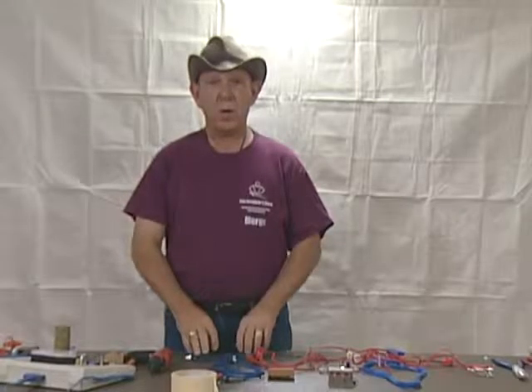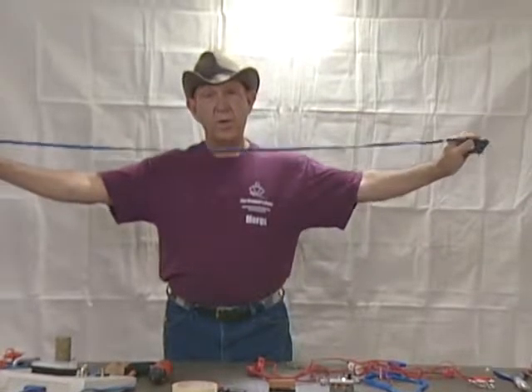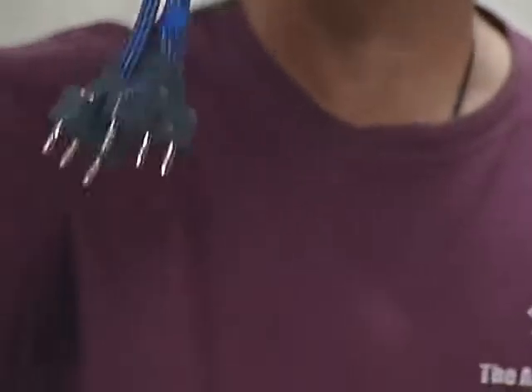We have covered the inspection, maintenance, and repair of body cords. One last note: the proper way to store and fold them is to take your body cord, fold it in half, fold it in half again, and then make an overhand loop. This way you don't put undue stress on the wires and cause them to break. Thank you for watching this video on the care and feeding of body cords. Please be sure to visit my website, thearmorestore.com, for further information and techniques and equipment for inspection and repair. Thank you.